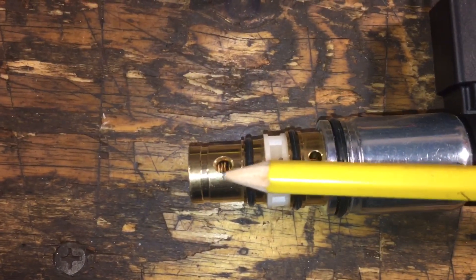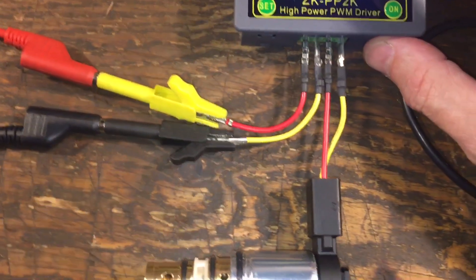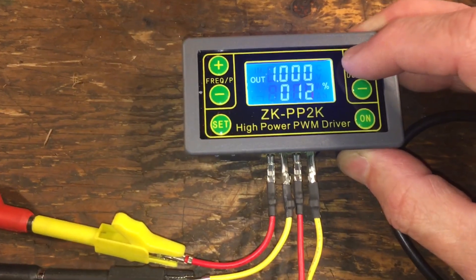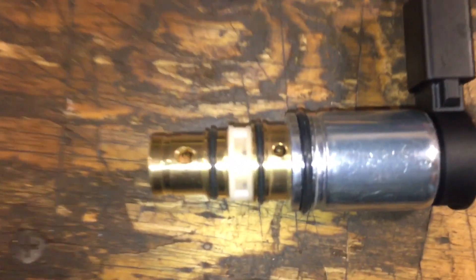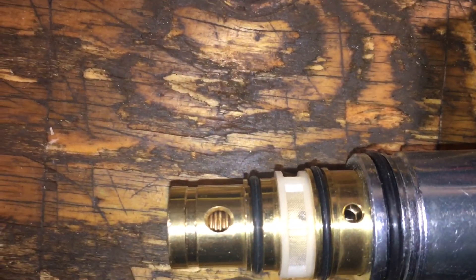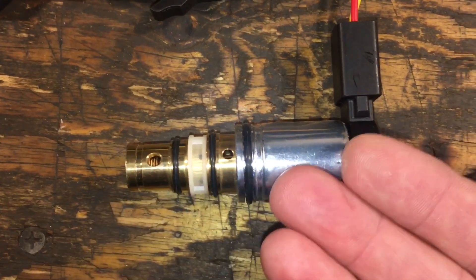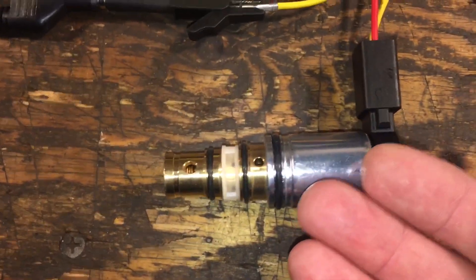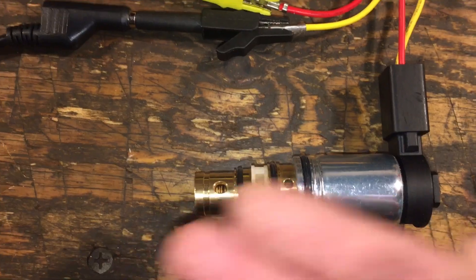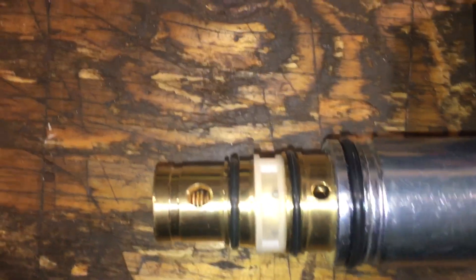This valve is just reacting to the bias spring here. I'm going to ramp up the duty cycle — I'm at 20% here now. You wouldn't have seen anything happen there anyway, because for the first 20% nothing really happens. The coil has to build a magnetic field in order to overcome the inertia of the spool itself and the bias spring. So for the first 20%, take my word for it, nothing actually happens. Let me ramp up now to 80%.